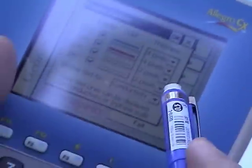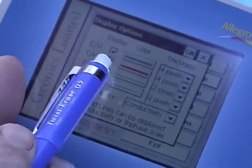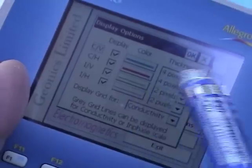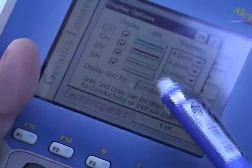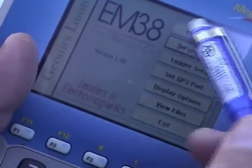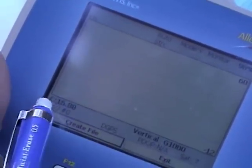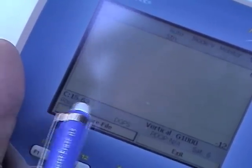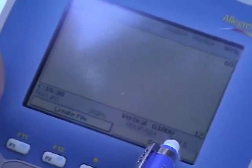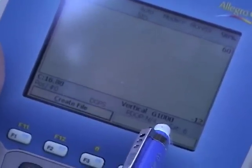Display options shows the different colors that can be used: conductivity vertical, conductivity horizontal, in-phase vertical, in-phase horizontal — with different pixel thicknesses and colors. I'll leave it as is. Now we've gone through all the options. Let's hit monitor and display. We see the conductivity; position is zero. We have differential GPS, PDOP, and we're tracking six satellites. We're ready to begin our operation.